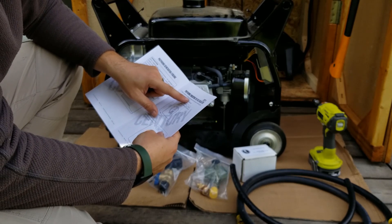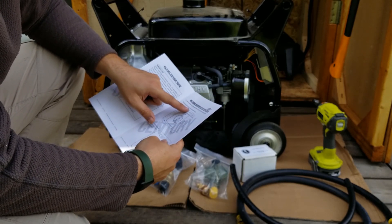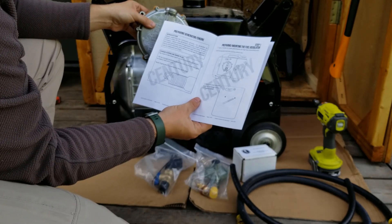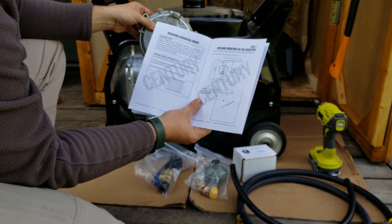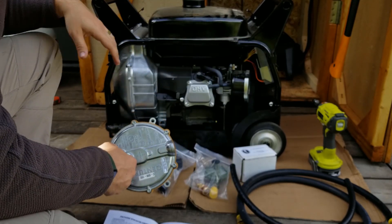Right here on the first page it gives me a little worried because I need a hole saw and I don't have one. I've got some wrenches but I don't have a pipe wrench. It tells me all the parts — a lot of these things are just what's in that little box. You use a marker to mark placements for the top two mounting ears, and the regulator has to be pointing up. Then remove the cover and drill holes using a one-quarter inch metal drill bit.